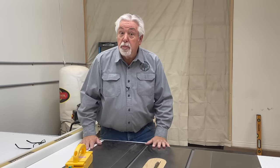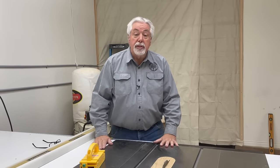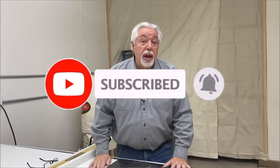Well, what do you think? It came together just like I had hoped. This is a big outfeed table for a saw — if you have a small workshop this might be too much, but the construction approach is the same: start with your space, decide how big you want to go, build sturdy columns, put a nice top on so you can slide wood across, and go to work. We'll be doing the rest of our shop very soon — a workbench, an assembly table, and a chop saw station. I'd like to invite you to subscribe and watch us as we put our garage shop together on Woodworking with Wes.